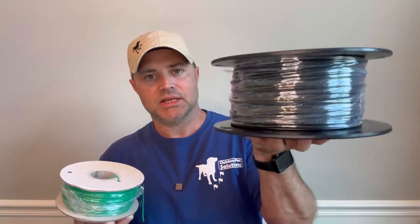This will get the job done and will last a hundred times longer. Early on when I got into the underground dog fence business, I went through a lot of different brands of wire using different manufacturers and suppliers until I found something I really liked and went with what I consider the absolute best. The reason I'm investing a little bit more in that wire — when I could save money with a different supplier — is that I warranty what I do, so I need it to last a very long time so I'm not going out on unnecessary repairs. I invested in this stuff here. This jacketing on this wire is very dense and very hard, so it can take a beating — you get this stuff and it's going to last you forever, especially if you install it correctly.